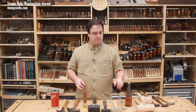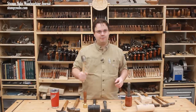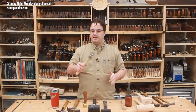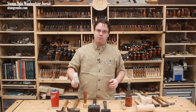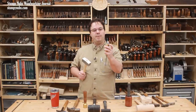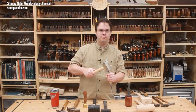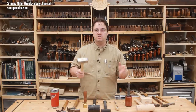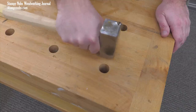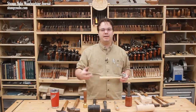Not all pounding has to be gentle though. This is called a lump hammer — don't confuse this with a regular sledgehammer. This is specifically designed for persuading, not for smashing. These have long been used by woodworkers for chopping and assembling joinery because the two-and-a-half-pound weight of the head can do a lot of the work for you. It takes a lot less muscle power to chop a mortise in hardwood with this than with a wooden mallet. It can be a little hard on tool handles if they aren't banded with metal to prevent mushrooming, but you'll be surprised how much you like letting the tool just drop and do the work for you. A lump hammer can also be used to assemble dovetails, carcass construction, and other types of joinery by choking up on the handle to vary between strong blows and delicate taps. I got mine from Crucible Tools — it's a premium tool — but you could try out a small two or three pound mini sledge just to see if you like that kind of hammer.